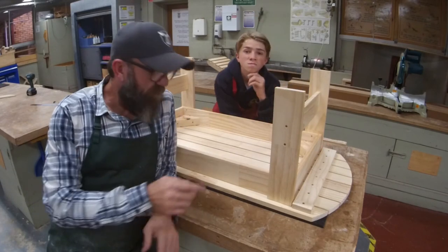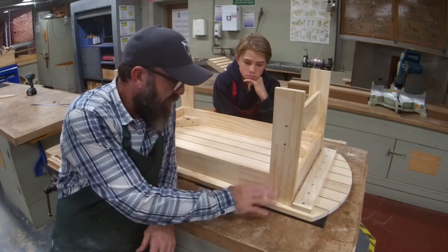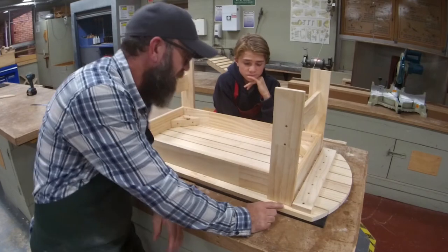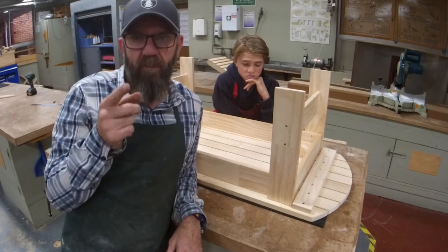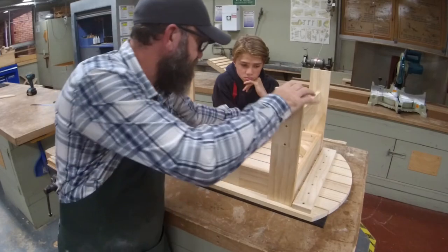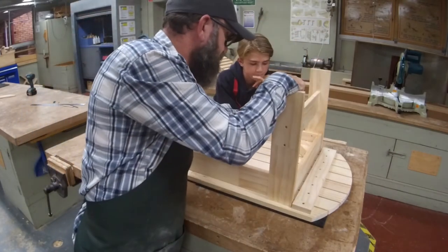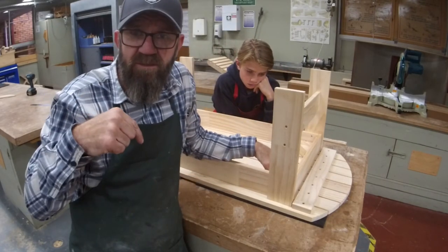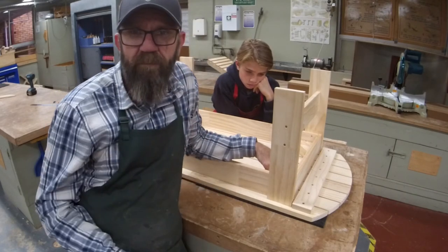Alright, if you've done a good job, put a blanket down or carpet tiles or something to protect the top. And if your frame fits in the rails in the tabletop, you're winning. Good job. The last bit's really easy, but I will change the camera angle because you need a countersink into our chunky triangle corners in the frame that give it the rigidity. We're going to countersink into those a certain amount and then just four screws into the top.